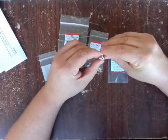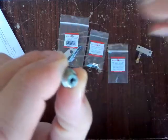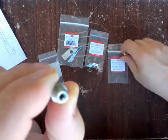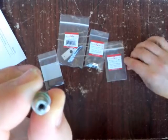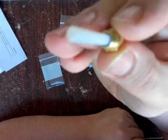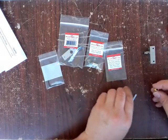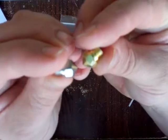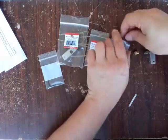One thing you're going to notice right away is that the new nozzle isn't big enough to accept a PTFE tube. The original was — it's a much larger opening because the original intended to have a PTFE tube inserted in there. If you happen to buy this, you're going to have to take that off. That's one major difference. You can also see that the material it's made from is quite different.